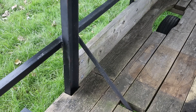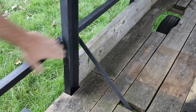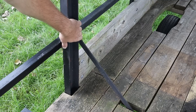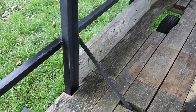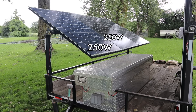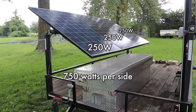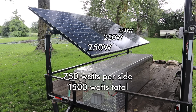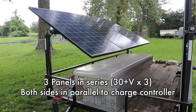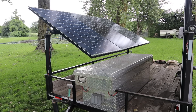On the back, there wasn't a cross rail the way there is in front, so I did use some angle iron diagonally as support for the rear uprights. The solar panels are 250 watts each, so that's 750 watts per side or 1,500 watts for both sides together. That's theoretical under good sun conditions, but in theory it's capable of 1,500 watts.